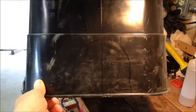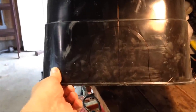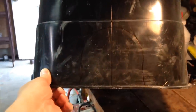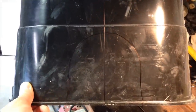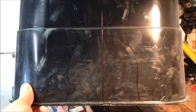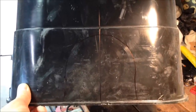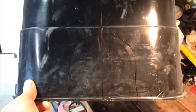I kind of just drew a straight line down with the Sharpie and got a square just to get an idea. It doesn't look like it's perfect. I took my scrap piece of pipe and put it where I need it, drew the half circle there, and then just generically finished out what I need. I'm going to take my spiral saw and cut that out — you could probably use a razor knife too. I'll show you how that works out.